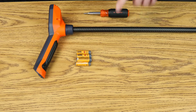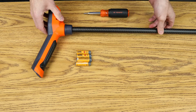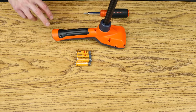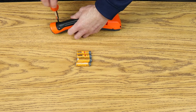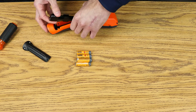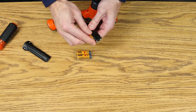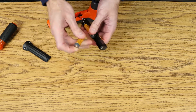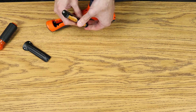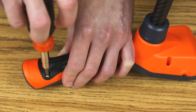The receiver requires four AA-cell batteries. To open the battery compartment, remove the two screws on the underside of the handle, remove the cover, pull out the battery holder, and install two batteries on each side, observing the polarity indications. Reinsert the battery holder, replace the battery cover, and tighten the screws.